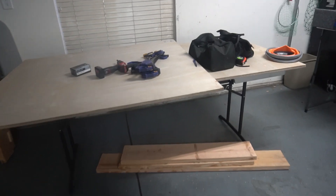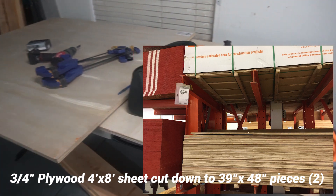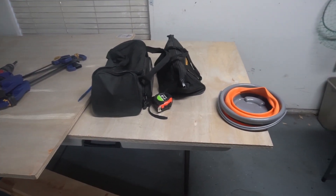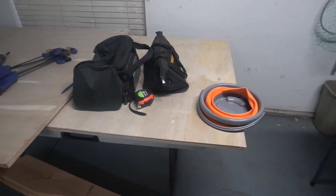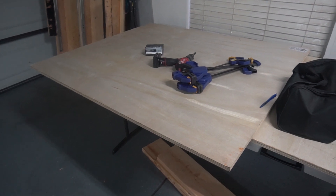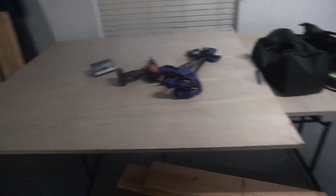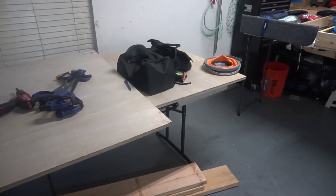Let's take a look at some of the parts I bought. So I got a piece of plywood — it's just a standard 4x8 which I had cut down because it wouldn't fit in my 4Runner easily. I took one measurement so far: 39 inches for the topper, and had them cut it down to 39 inches, so it's 39 by 48 right now. I'll just do the final cuts. This other piece I'm going to cut down for the sliding portion of my drawer system — I actually want this piece to be sliding from the top instead of a traditional topper.